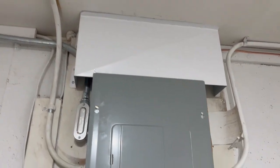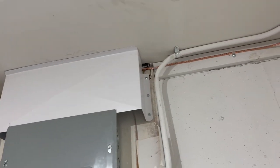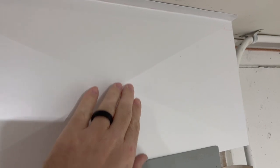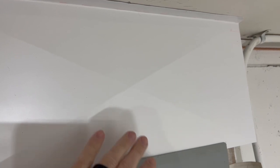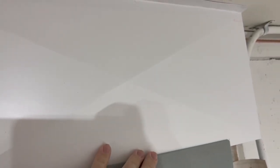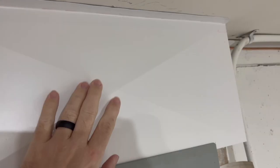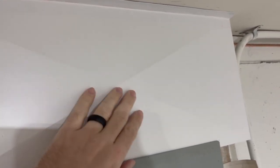Installed — completely blocking any access to that Romex. Pretty happy with that. Someone's going to ask why I bent this X in — it's for structure. If it were flat, it'd be easy to press in and would be concaved. With the X, it adds rigidity to the panel, something you'd do in a plenum or duct in an attic or basement. They used to do it in all the ducts on entire runs of rigid metal, but now most folks use insulated accordion flexi duct in attics instead.